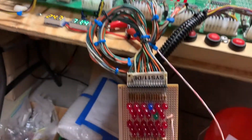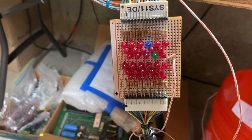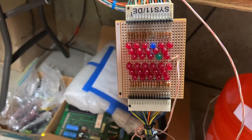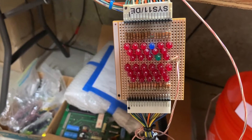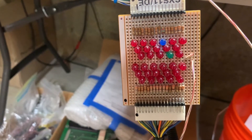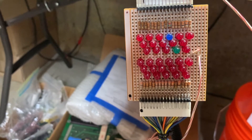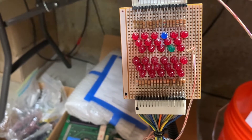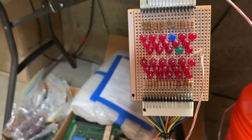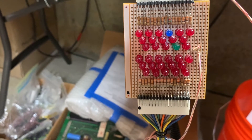And we'll cycle the coils. Some of these coils will stay on for longer or shorter durations because the game software knows what kind of coil is there — those were the flipper coils, for instance — and it knows that it can pulse them for longer or shorter periods of time. The first four here are skipped in Starship Troopers because those are the stepper motor drive signals.